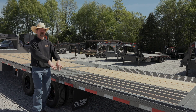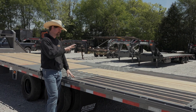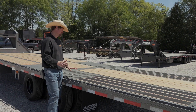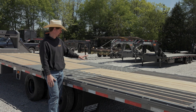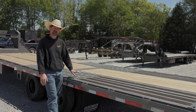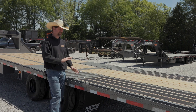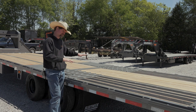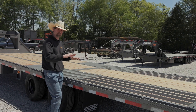You're just going to need to move the skid steer until it can lift it. What bends these tails is placing too much weight on here — loading it too heavy. Maybe you're using a forklift and you're side loading, or maybe you had a machine and lifted the tail and then drove it back for extra deck space. But if you loaded the tail too heavy and then drove down the road, the constant road shocks, bridges, and potholes — that is what will bend the tail.